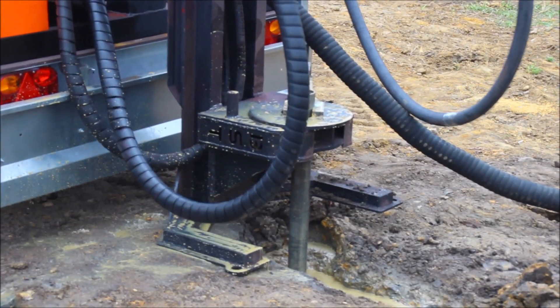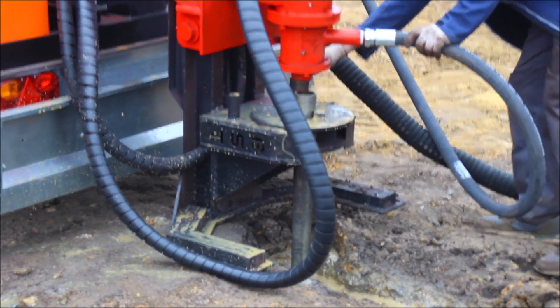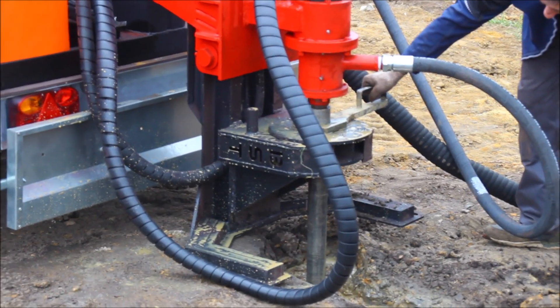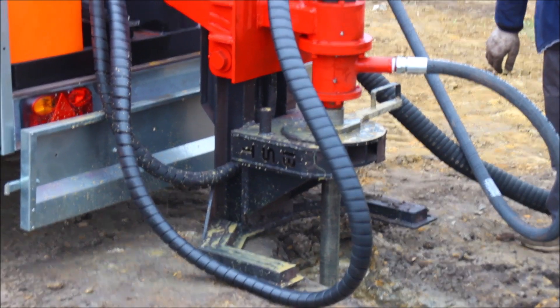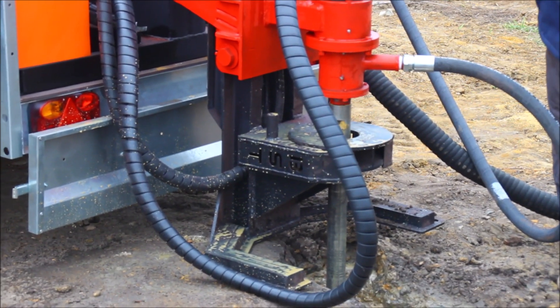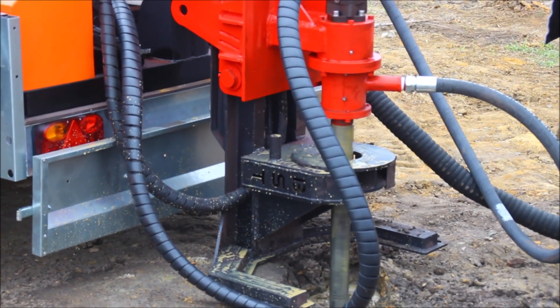The process of testing of three drilling pipes has been completed and now you can observe the lifting of the drilling string, which is also performed using the universal drilling wrench put on the professional drilling table. After rotating the drilling string, you disconnect the pipes one from another.